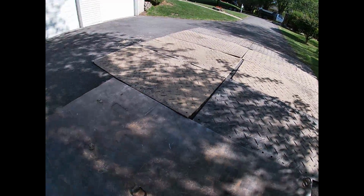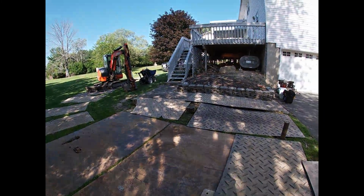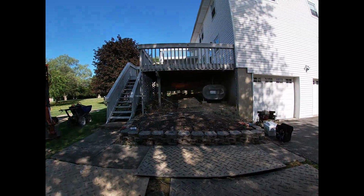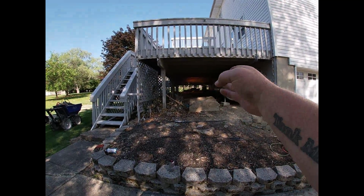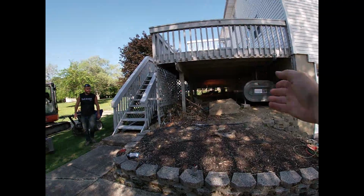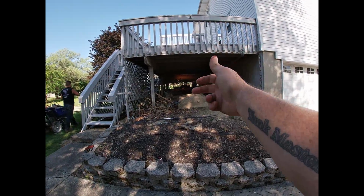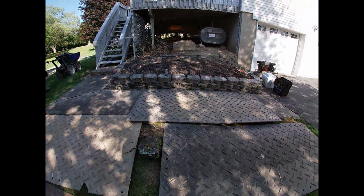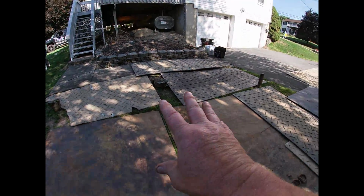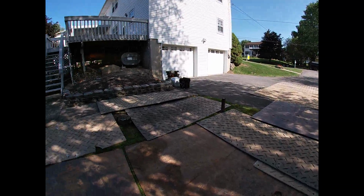All right, we've set up 3 plates, all the ground protecting mats. So my plan is, after we pull this pad out of here, I'll have 2 conveyor belts where, when we hand excavate, after the tank is removed today by Mr. Corey Stokeland, 2 conveyor belts will load up. We'll sit right here with a skid steer. The conveyor belt will go into the bucket, the skid steer will back up and turn on these metal plates so we don't damage anything. And then we'll load it into a Mason dump truck. That's our plan.